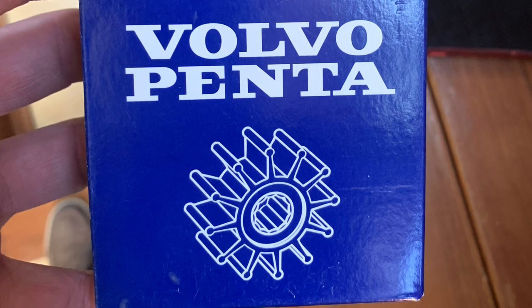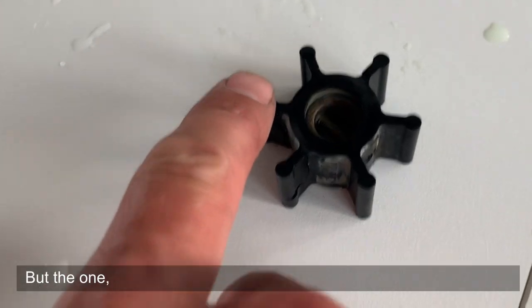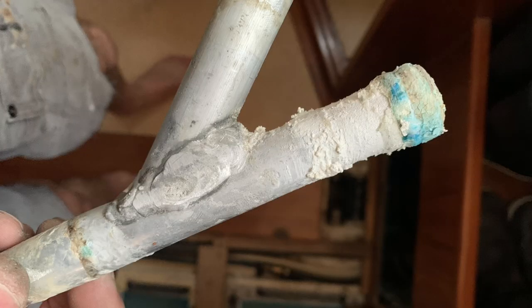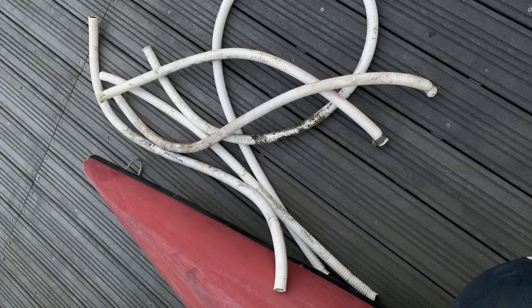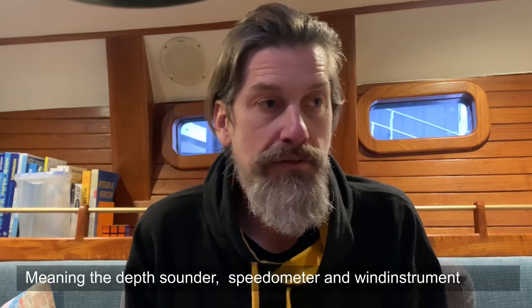Back home, two items on the to-do list: one, buy a new impeller — because you need it especially when you need it — and two, find all the pieces from the old impeller that were somewhere in the system. I got off all or most of the hoses and found all the pieces of the impeller. But I also found the hoses were not all that fresh anymore, so I decided to replace the hoses as well since they were off anyway — after 20 years of service it couldn't hurt. Once that was done, there was one more big to-do: getting the electrical system up and running.